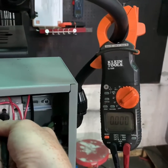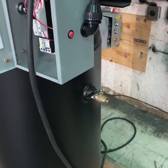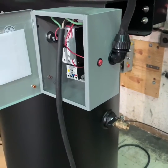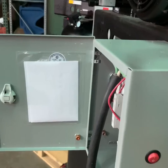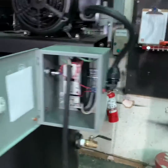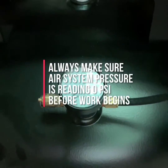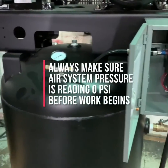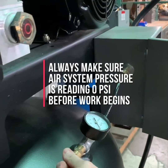The next step is draining the tank or system pressure to make sure the compressor is safe to work on. Once you have verified the power is off and disconnected, drain the system pressure from the tank down to zero. You can check by reading your tank pressure gauge to confirm it reads zero, and also by pulling the tank safety valve, which is typically located near the gauge.